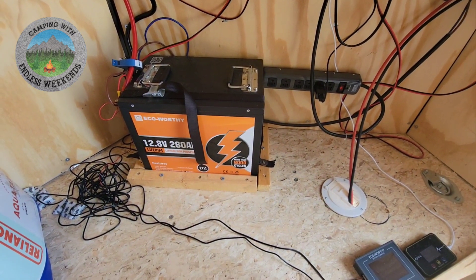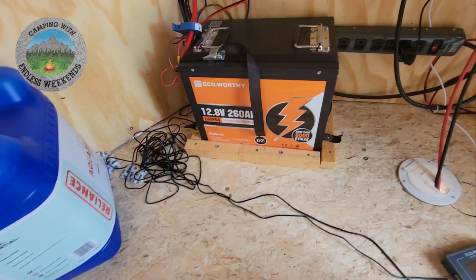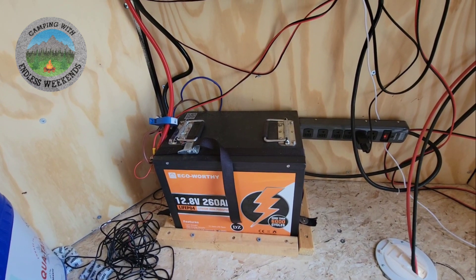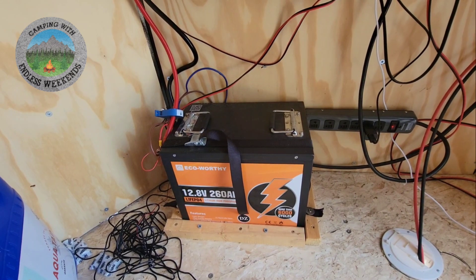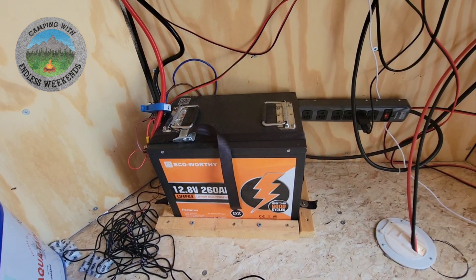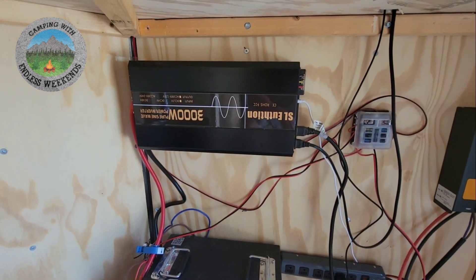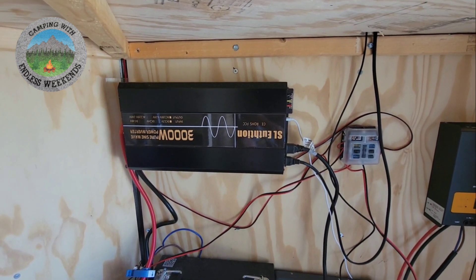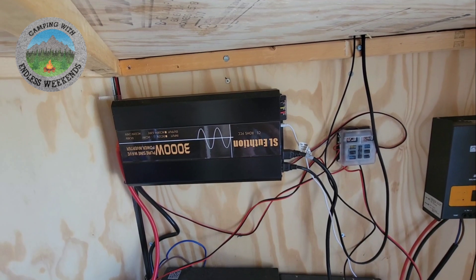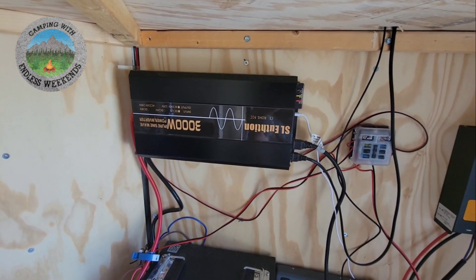Camping, I will probably never need any more battery. This has a 15 year lifespan with 6,000 cycles and a built-in battery management system. That would probably last me camping as long as I need it. Now if I was living in this full time, I would probably need more so I can cook three meals and be comfortable — I would never run air conditioning. With my TV running it pulls 22 watts. I have a 19 inch TV with the inverter pulling 11 watts — that's 33. The black fan pulls 30 watts or 44 watts on medium. So mostly I was running like 75 watts total with just an extra fan and a TV.